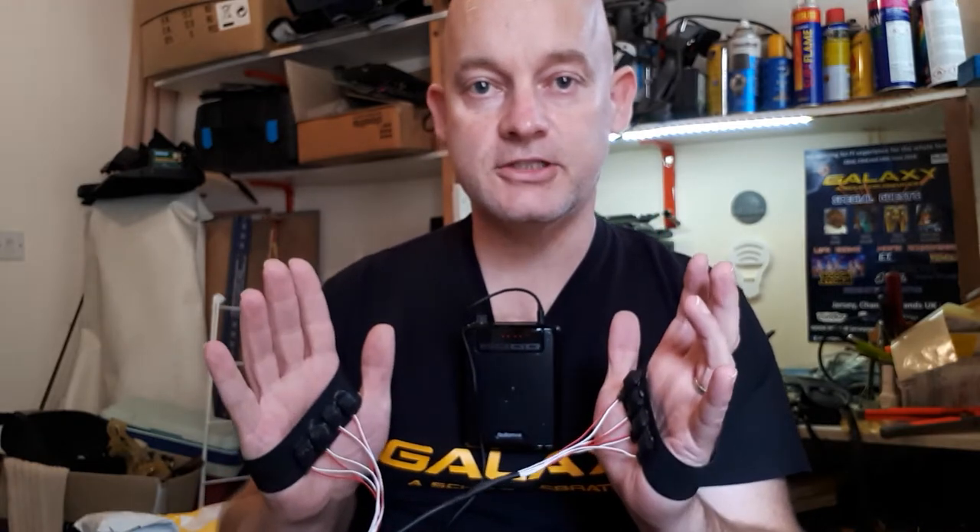So if you have got dexterity with your fingers then this is an ideal system for you. If not, stay tuned because we are making a system that operates off magnets and reed switches. All you'd need is either a reed switch or a magnet on your finger and we can hide the switches somewhere else in your costume — say on your thigh — and all it means is you brush your hand towards that spot where we place the invisible reed switch on the inside of the costume, and the magnet does the job of pushing the button for you. That's something we have got now and can build for you, so obviously talk to me about that.